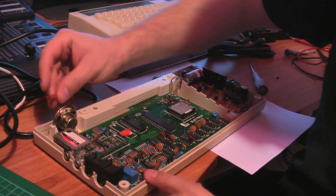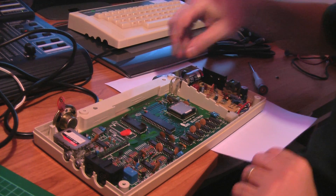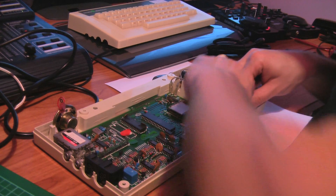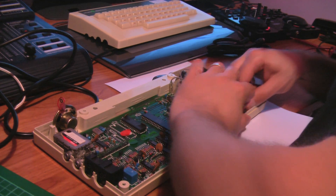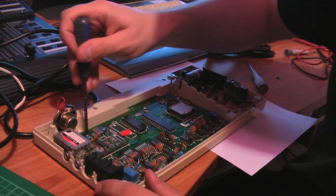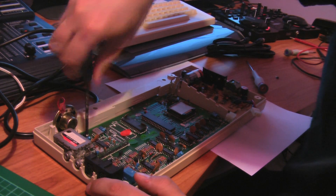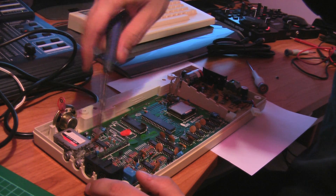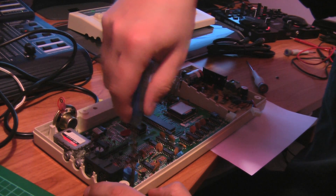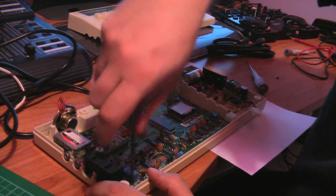Let's go to Donna the donor board, who will be giving us two jumpers. Now you could just solder a link across these two points, but I'm quite anal about things like that and I like things to be reversible. So I'm going to steal two jumpers off of this old motherboard and solder them into the LK. You can see Donna's via bridge went pop through excitement. Let's pop this speaker off of there, and hopefully at some point this hideous music will end. Disconnect the power supply, try not to shock yourself, and remove the screws out of the motherboard.